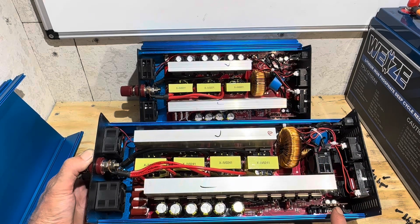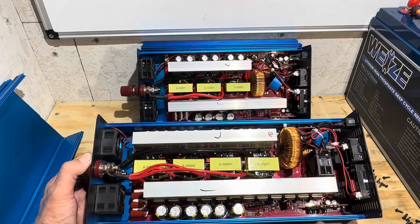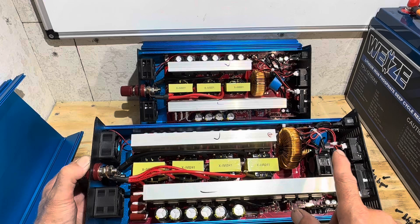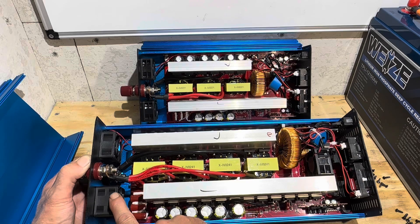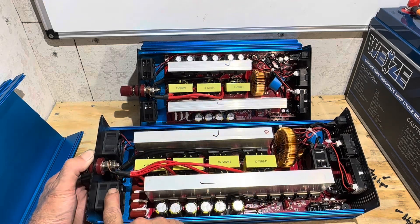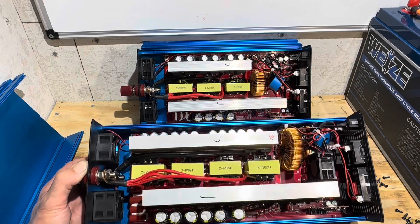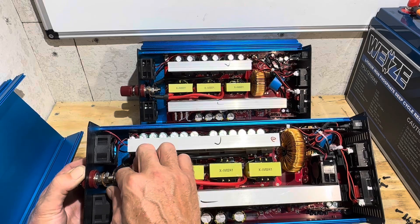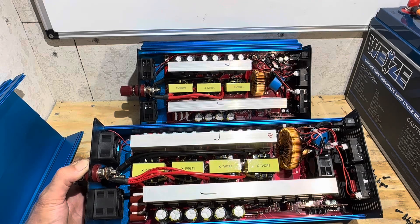Same control circuitry. The output is 110 volts — no adjusting up to 120 volts, but I've explained the reasoning behind that in other videos. On the 24-volt model there's an additional cooling fan on the heat sink, and it's got a ducted exit to direct the airflow better, whereas the 12-volt just blows however it wants to. The 24-volt directs the airflow closer to the heat sink, which should help it run cooler. Otherwise, very similar wire layout and terminal layout — just upsized for 24 volts.